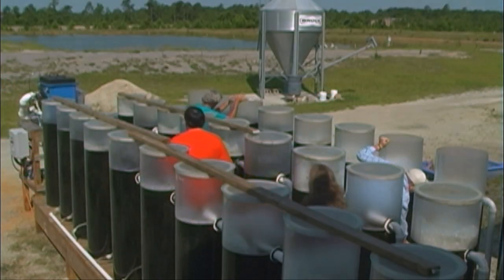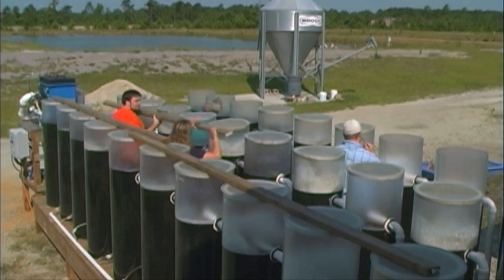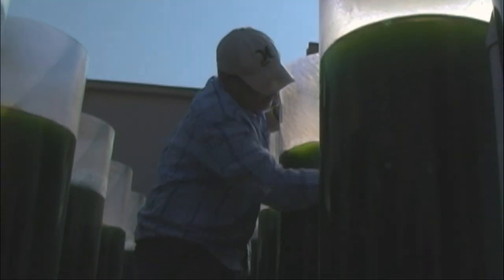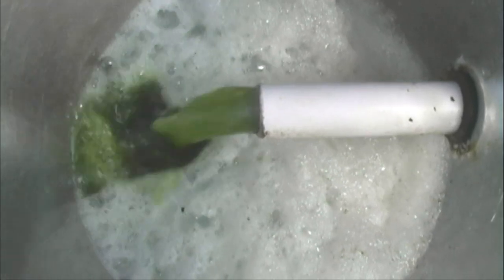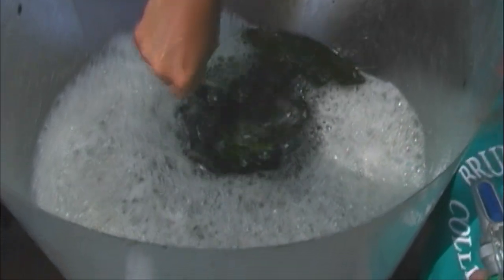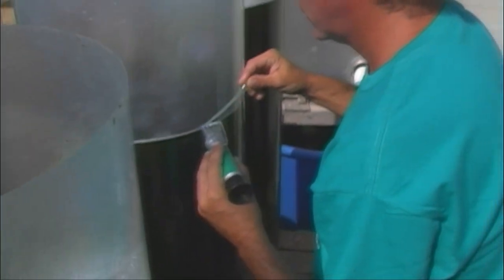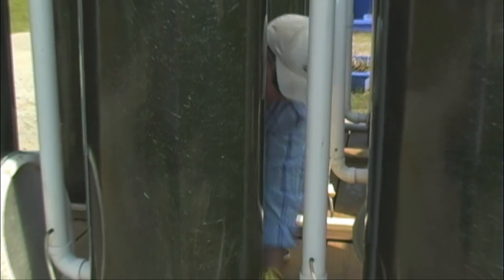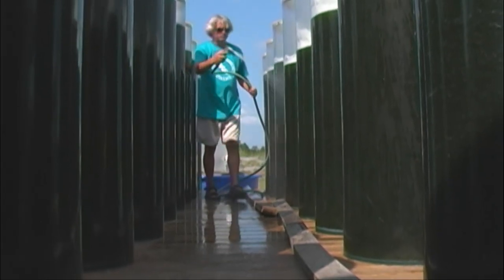Next, the cultures are transferred to the photobioreactor system. In the past, these 60-gallon fiberglass tubes were used to grow algae to feed shellfish. The tubes are now part of a new 1,800-gallon system designed to produce algae on a large scale, yielding very dense cultures of single-celled and colonial microalgae with high lipid content and fairly pure cultures — sufficient to produce a dense crop of algae for algal oil biofuel production. Regular maintenance involves cleaning the exterior and interior of the tubes to maintain proper light penetration and maximize algal growth.